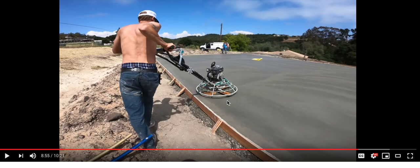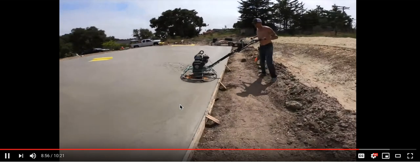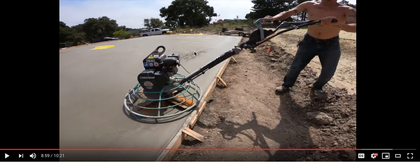Let's see it in a minute. Right here I was like, what's going on? He's spraying water down here — that's not bleed water, that's extra water. Bleed water doesn't just all of a sudden pop up in the middle like that. The pad is clearly in the middle — he's always at it in the middle of the pad. Started here — third truck got us over to there, and then the fourth truck, our pumper had to take off, so we tailgate. Max it up. Look — that's nice and dry, no bleed water. He's finishing it. No harm done right now, but at some point you've got to full set, and you're not doing anything besides tearing the concrete apart at that point. It won't rebond with the surface.